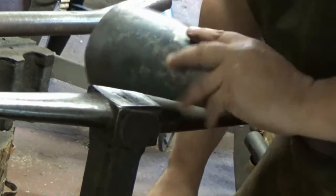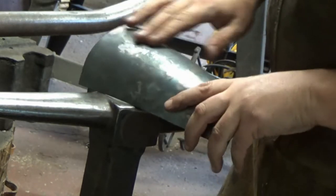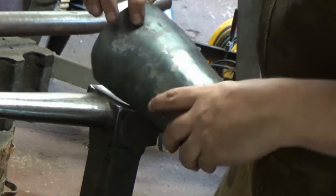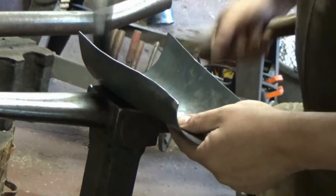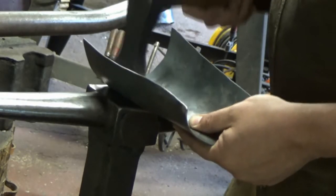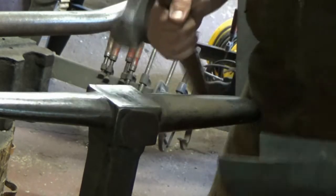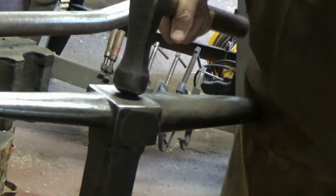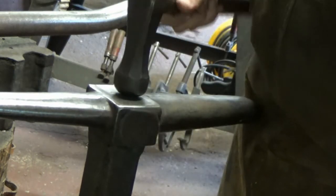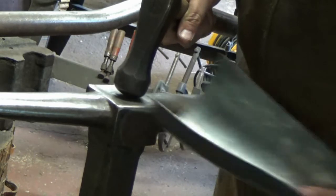A quick check on the surface — best to use your fingers and your eye. The fingers will generally always pick up what's going on. I can tell there's some more rough area over here and a slight divot, so again just offer that up — you can see it on this side — and work it back. It's imperative not to be too hard. It's about gentle persuasion; you're just pushing that material ever so gently. If you rush your planishing you can murder the piece and distort it very easily.